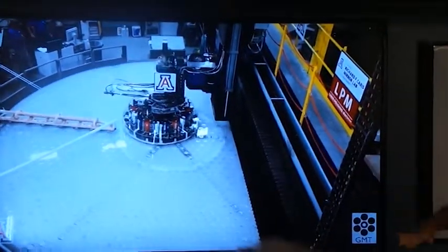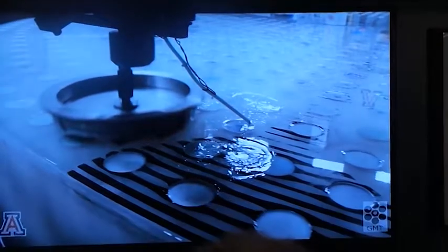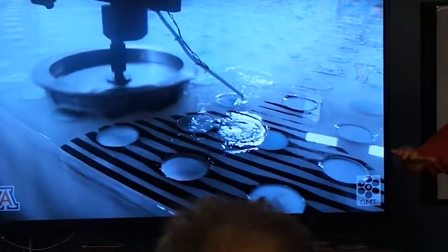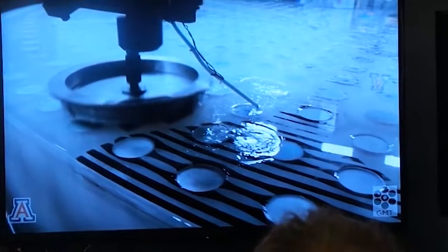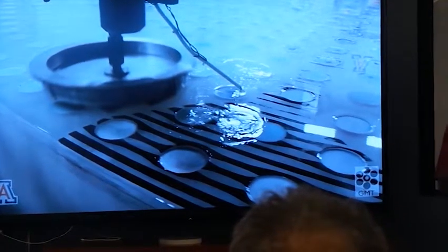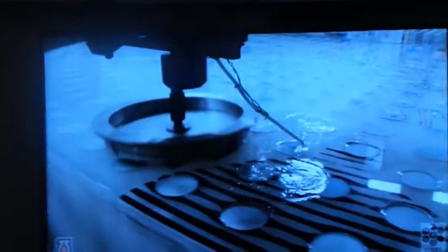And the first thing we do, this is the back of the mirror. We are going to polish that flat, and we're going to attach about 175 load spreaders, which will spread stress across the mirror, and each of the load spreaders is hooked up to a hydraulic actuator, because if you're working and the wind is blowing from the wrong direction, the mirror starts bending the wrong way, so these hydraulic actuators push back. And since these are going to South America, we provide earthquake protection, about a 4G shock all at once.